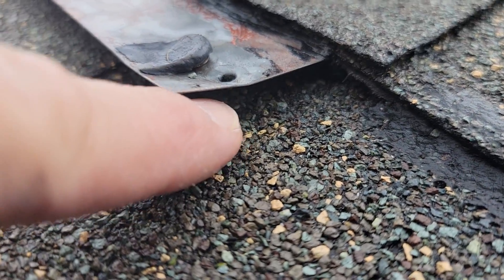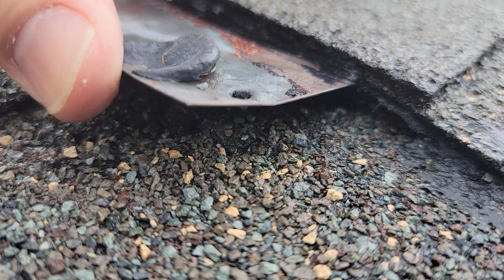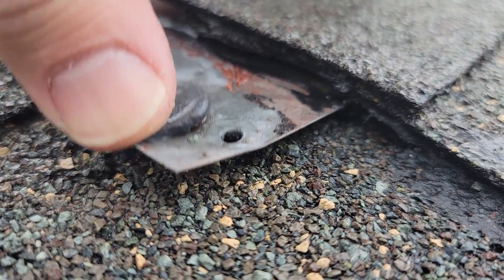A galvanized nail is just a coating of galvanization on the outer edge of it — it's still ferrous, it's still going to rust. Over time, it'll take for that galvanization to wear out, rust out, then rust the nail in, reducing the diameter, making it where water will trickle in. So when water gets down here and it gets on that nail, you see that hole it's going into? It's just saying, come on in, follow me down — gravity pulls it right down the hole.